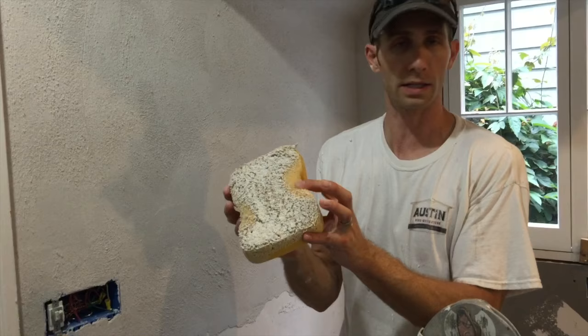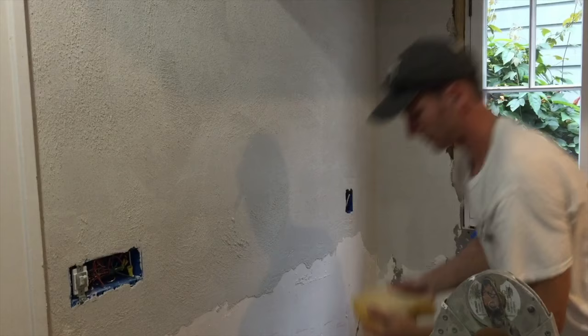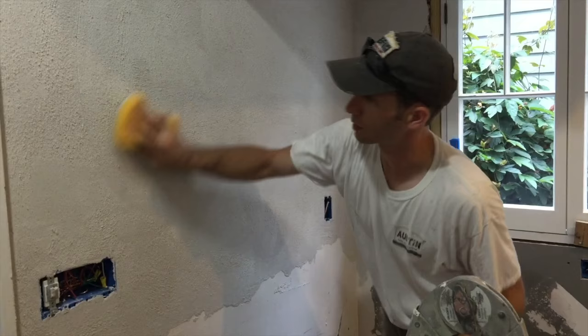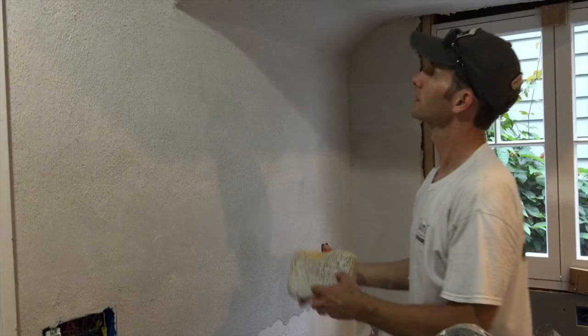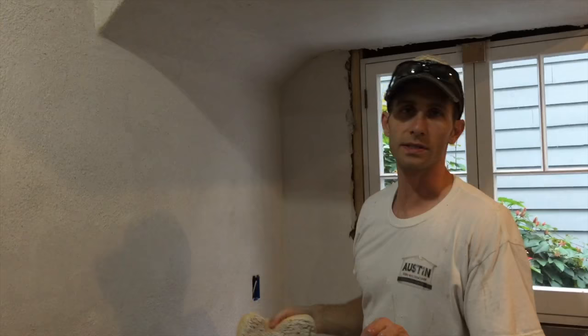You just come through here. You're using just a normal tile sponge — I like using the rough side, it really gets in there. Keep a bucket of water handy and rinse it out every couple of minutes. Once this is all dry by tomorrow, we're going to have to come in and knock off some of the rough sand grains that have pulled up to the top, because they won't stay on once we go to prime and paint. This is how you do the sponge float — some people call it a turtle back texture. It's a really good beginner way to get a nice, smooth, consistent texture and not worry about some of the divots that show up in the plaster. So there you have it.